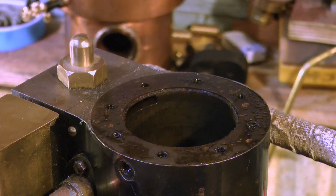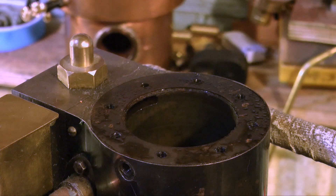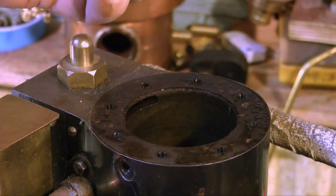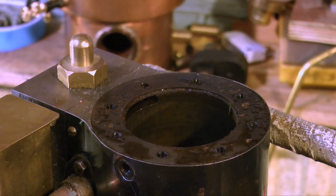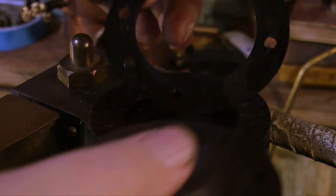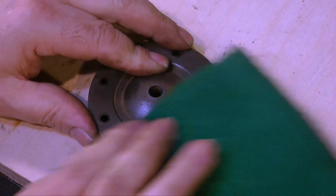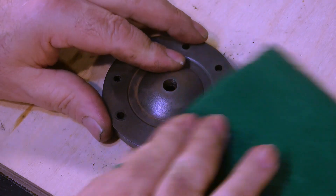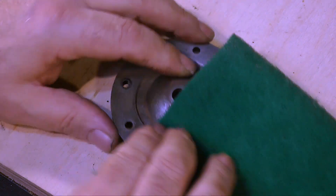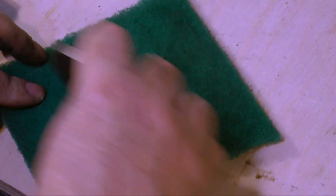This is very interesting what I'm seeing inside. For those who don't know much about steam engines, it won't mean a thing. But if you notice how black everything is, that tells me the engine's been run using a steel boiler that's had water treatment in it. There's some water treatment stuff called DM, and it puts a heavy coating of tannin — T-A-N-N-I-N — on the metal parts, which helps to prevent rust. That's what this black stuff is. I think tannin is also responsible for preserving bodies found in bogs — it occurs naturally in peat bogs. But as this is outside my range of expertise, I'll keep quiet about it, as I really do not wish to upset any academics out there.